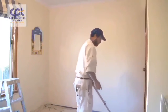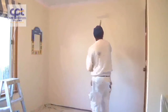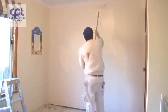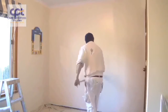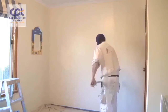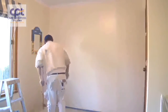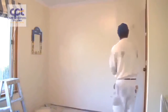So now I've got to there — it's pretty much just repeating the same process. Once again, about half a roller width away, spread the paint out. I haven't got quite as much on this dip. Also a handy tip: always have your roller tray close by, and not on the other side of the room like I've seen some people do.